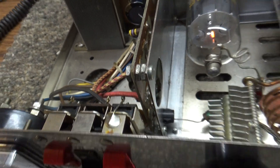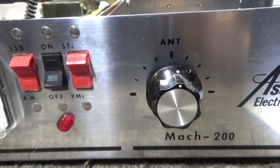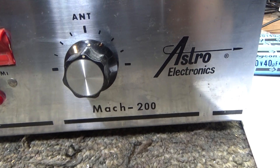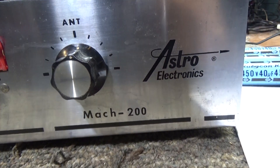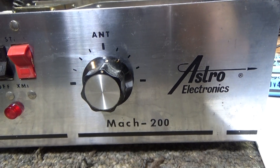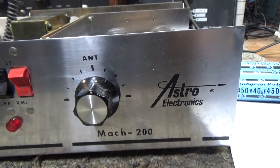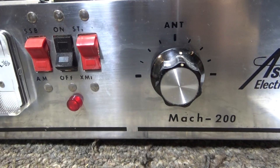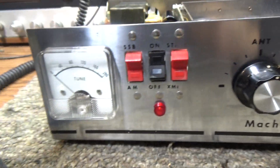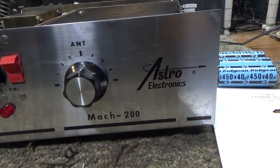Since this switch is braided in and it's an extended long switch, we just bypassed it. So as soon as you plug it in, you've got power. All you've got is standby and AM/SSB, and one load knob for tuning. No preamp, no frills, no variables — nothing. Just on/off, which doesn't work because I've got it on all the time, AM/SSB, standby, on-light, and a meter.